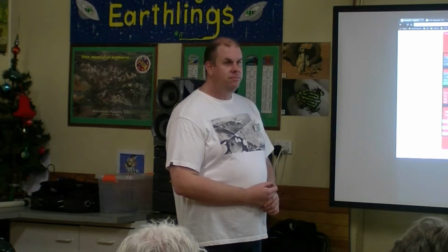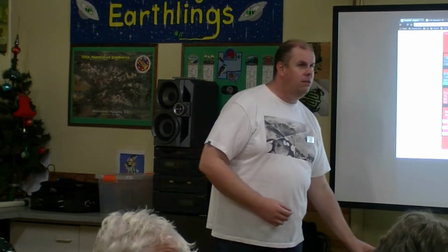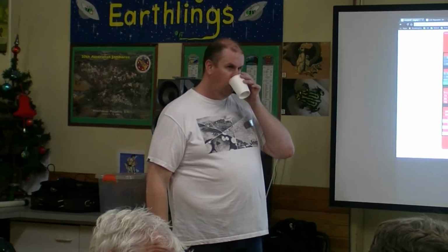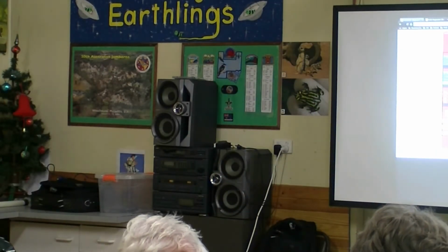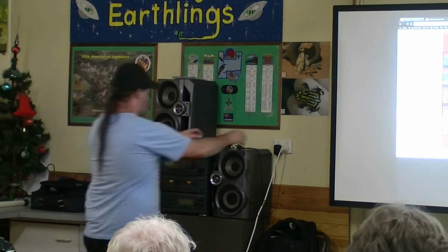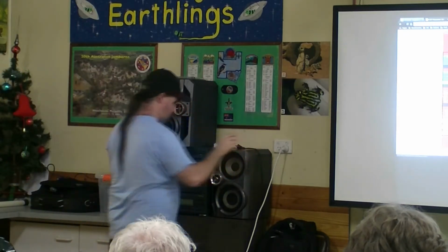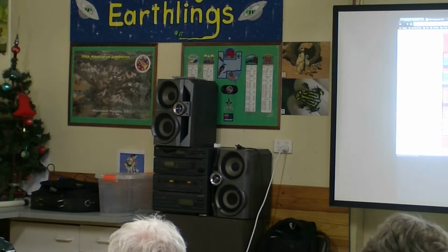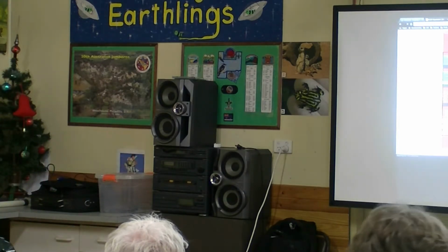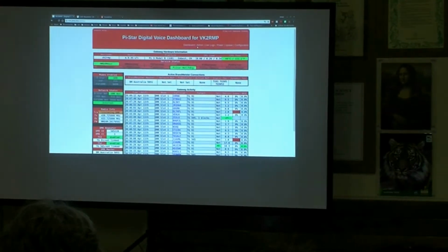Yes, so you said you've got DMR turned on there at the moment. Yep. So if I've got my P25 radio, I can't go through that unless there's a bridge from P25 to DMR. I can turn P25 on. Aha, that's what I'm saying. Yep. But if it's DMR, I can't go through P25. But that means when it's talking on P25, you won't be able to use DMR. Yep. So see how that's just gone red on us? That's it. You can't use anything other than DMR. And while that's orange, you can't use anything other than DMR.